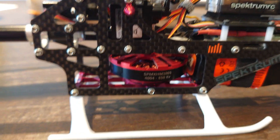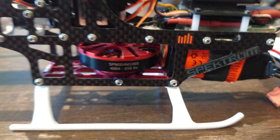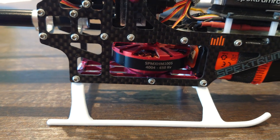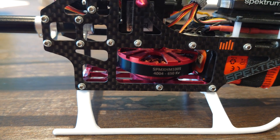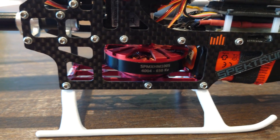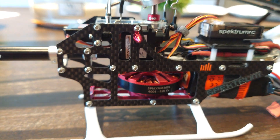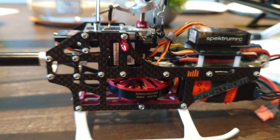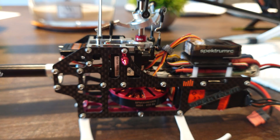I would buy some parts for the Fusion 180, like the lower frame, and either some of the screws wouldn't be tapped in all the way — the hole would be halfway done — so my screws would be sticking out and wouldn't really clamp anything. I'd have to install washers to compensate. Also, I noticed their aluminum material strips so easily.